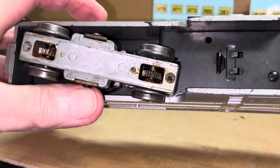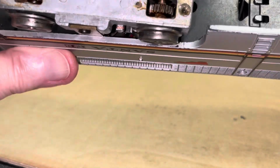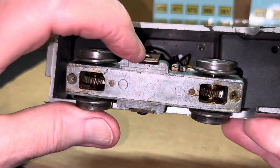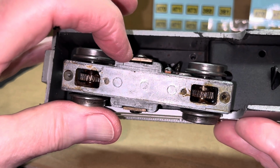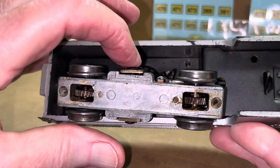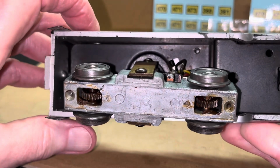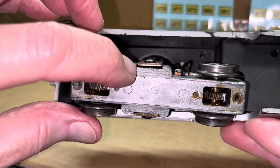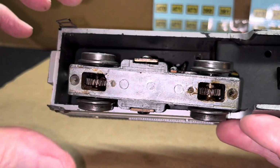We've already noted that this motor mount or field mount or field bracket, which is a combination, you'll note. This is the combination field and motor assembly yoke. You notice in other trains later, Gilbert put in a separate yoke or mount for the field and then one for the motor. And they have a different type of screw. This one is a round head screw. It's relatively short when compared to those that hold in the double yokes. And you'll notice this one is separated a little bit. It should not be that way. It should fit firmly and snugly against that slot right there in the motor.